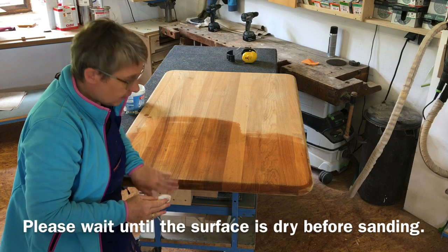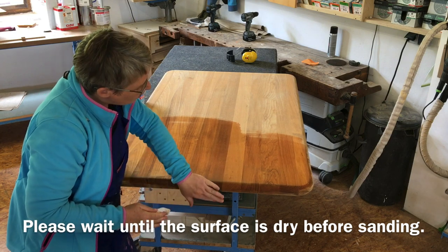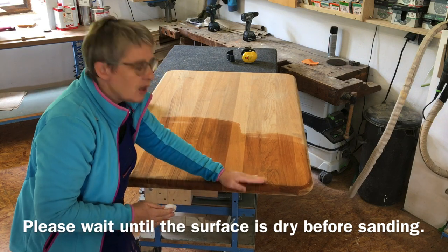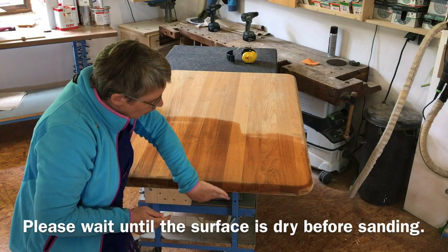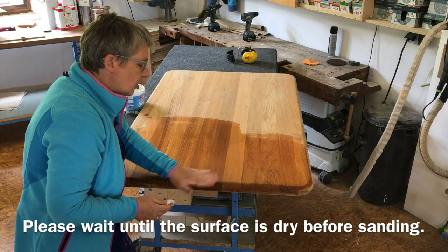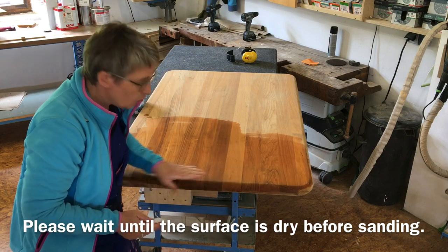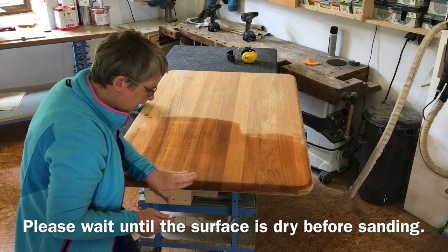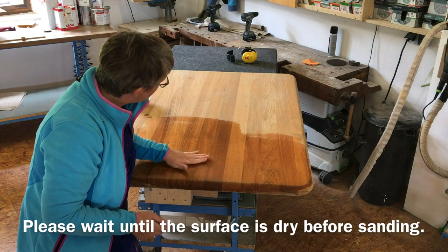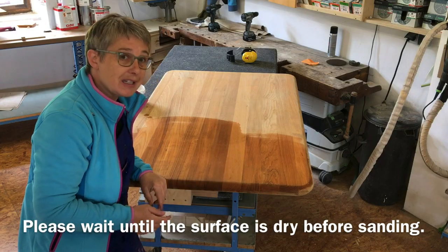This time I have to be careful. I have to sand the edges first. To do the edges it's a little bit difficult — you need a little bit of practice to get this curve right. I suggest before you even try it on your table, you actually try it on a piece of wood and practice a few times. How do you get this curve so that it looks nice and even? Otherwise you will get an edge that's not straight. You need to practice doing this curve on a piece of wood. I'm now going to finish watering this off and then get on to the 120 grit paper to sand.